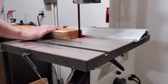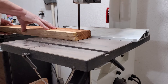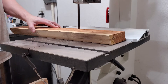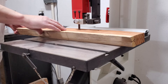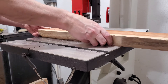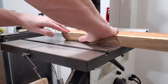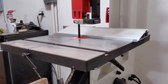Now we are cutting the supports that go under the bench and against the leg. I don't really know their technical term off the top of my head, so I'll just call them supports. They will keep the leg from hopefully collapsing sideways — because that would be really bad if somebody sits on the bench and the leg just kind of folds up. On the bandsaw — I love my bandsaw — that happened to be the tool of choice here.